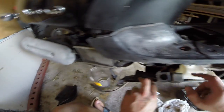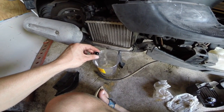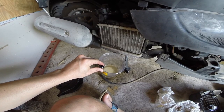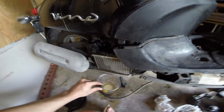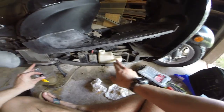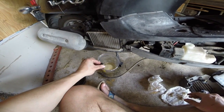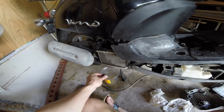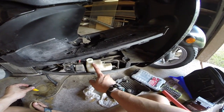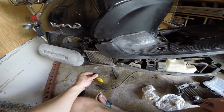I've been draining both of these. This thing is disgusting, still pretty bad. Here's my fourth or fifth drain — so it starts out clear and as it gets to the bottom it gets a little bit dirtier. Wow, this one looks a lot better than the other times. Finally you can actually see through the water. I haven't even done motor-running flushes yet. This was so disgusting that I realized I was going to have to flush the radiator and the coolant reservoir individually. This one I'm just going to have to pull out and completely clean. And this is a good sign — it's not as orange as all the other times. It was just coming out clay colored. I can see through it now. I might do one or two more flushes on this.